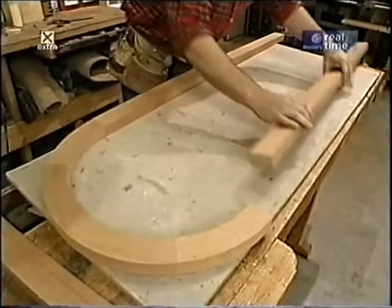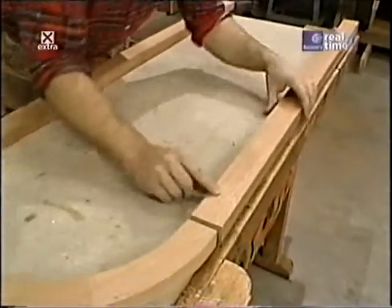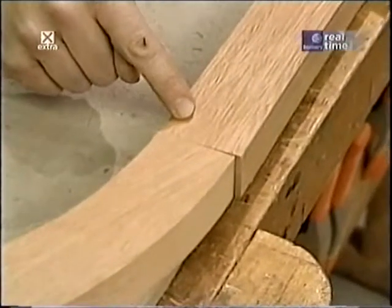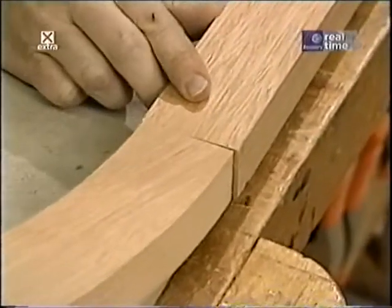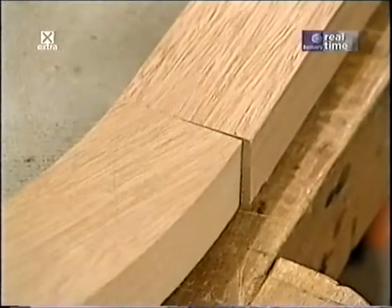Sequence is very important here. When I rough-cut the sides for the mirror I made them a little wider than necessary, because the final width can't be determined until the arch sanding is completed. Now that that's done, I can size the pieces — I can see I need to trim about an eighth of an inch, and I'll do that at the table saw.